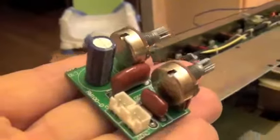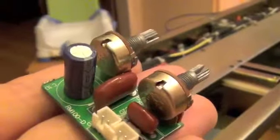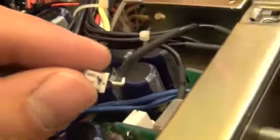Okay, by this point now you have pulled your connectors, your old presence and density board, and now we have in here our Salvation upgraded board. What we want to make sure we do when we pull these connectors, you can't really see the writing very well, but you want to write with a very thin permanent marker, such as this one.